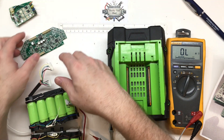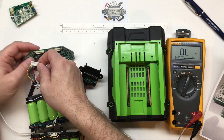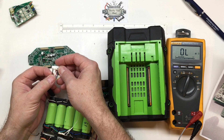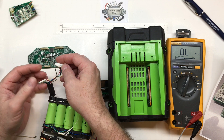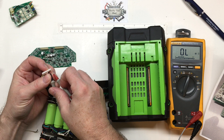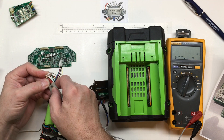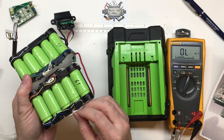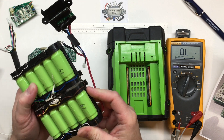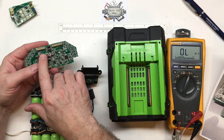If you're getting some temperature fault or flashes on your BMS that may indicate a temperature fault, you're going to have to go a little further and look at these two thermistors. The way these plug in — you've got your two black leads together as a thermistor — and if we check these out of circuit we should get around 10k and they should read close. One is about 10.4k and one is right at 10k. I had been handling one when I dug it out, but that's still fairly close — it should equalize pretty well. That's the best way to check the NTCs.